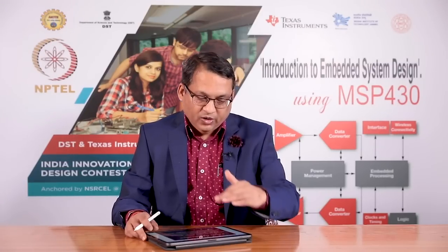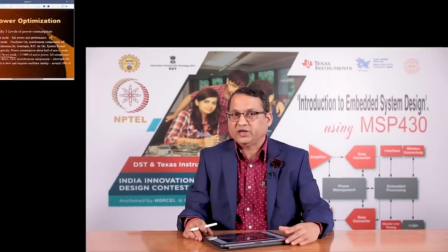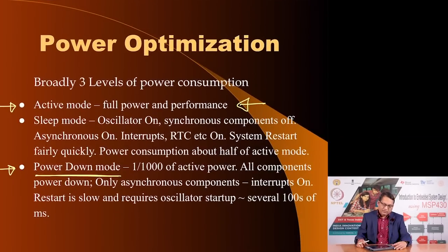And to get back into any of the other modes, sleep or active mode, you have to press that so-called on-off switch. You have to hold it pressed for a much longer duration, which ensures that the oscillator starts oscillating, the oscillations are stabilized, and only then, when the clock oscillator starts working correctly, does it activate the rest of the circuitry on your microcontroller, and then it starts working. So these are broadly the 3 modes of operation.